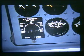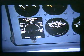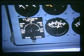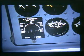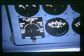The voltmeter has been converted to a split-scale meter. Notice that the 115 volt indication is approximately opposite the 26 volt position, to the right of center. The selector switch has been changed slightly by placing the captain's and first officer's instrument positions as the last positions of the switch, rather than adjacent to the engine instrument 26 volt AC position.